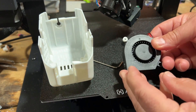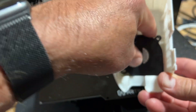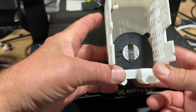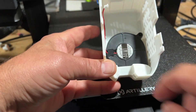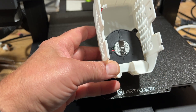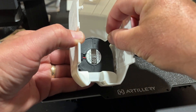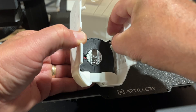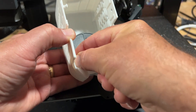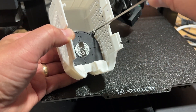It pushes in just like that. We can simply grab this and stick it down in — notice it snaps all the way down in there flush. Then we simply need to screw it in with a couple 3mm screws. You do need to have your own screws. This side is supposed to have an 18mm M3, and this side over here needs a 16. Simply tighten them in.